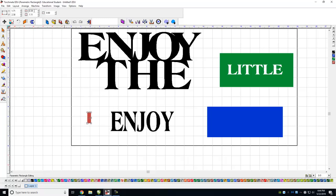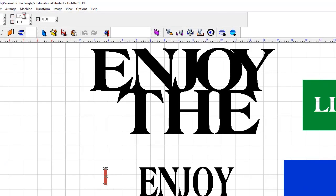The size of the bridge is critical. Make sure your font and design are at final size before adding the bridge, because we don't want the bridge to be proportionally wrong. I like a bridge to be at least 200 thou — or 0.2 inches — wide. The length doesn't matter as much; that can vary.